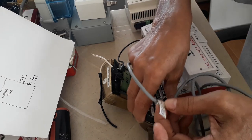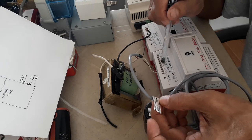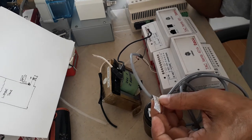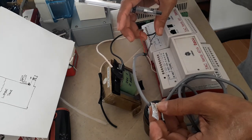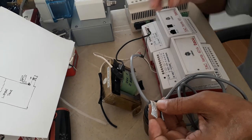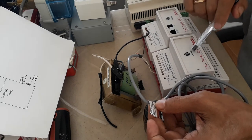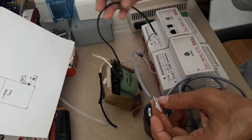The universal input will be configured to receive 0 to 10 volts DC. If you are pulling a cable for this differential pressure transducer, you need a 4-core cable — the power supply wires going to the device, and the white and screen used as your control output signal to be wired into your universal input or analog input on the DC IO module.